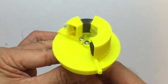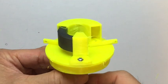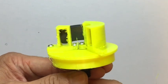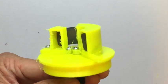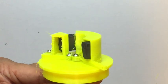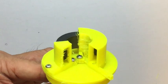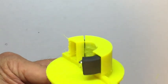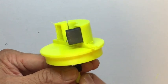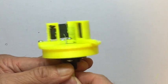And the application of this ring variometer is number one for connecting as a coil to the crystal radio, and then you can pair up with a fixed capacitor and tune by just turning the ferrite core like this. The second use case is if you have a long antenna, you can wind a lot of turns in the coil here and use this to tune your antenna.